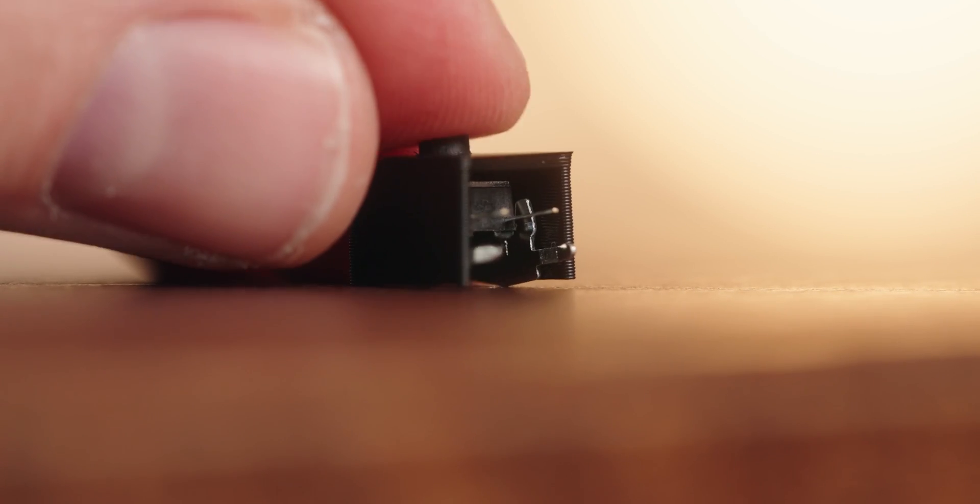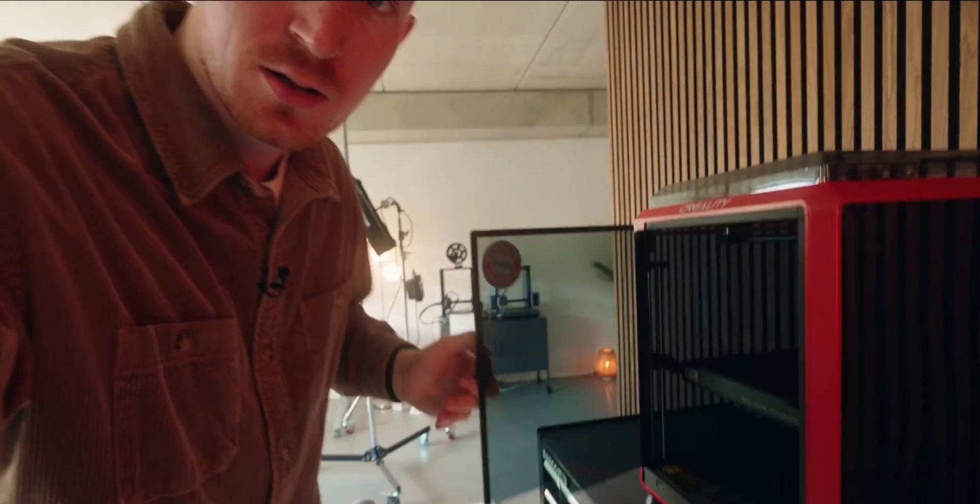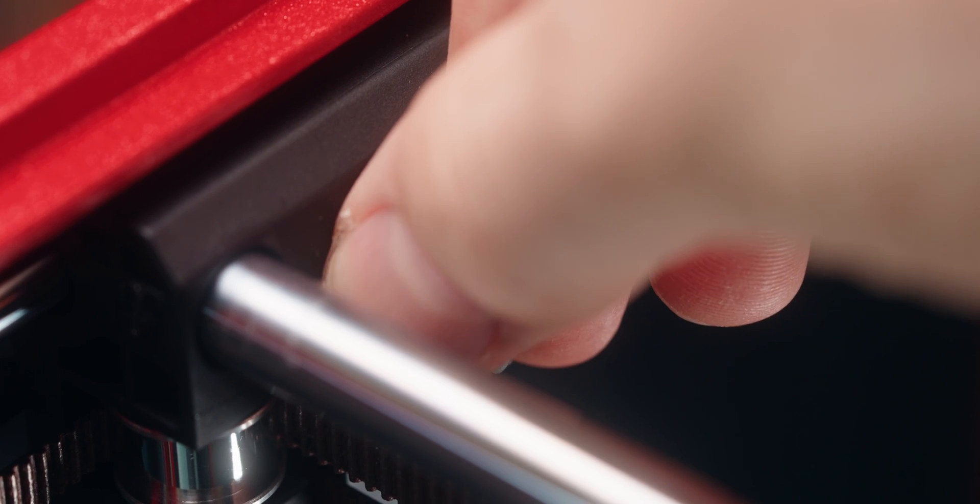V1 of the casing for my button has an issue — the hole diameter isn't big enough so the button can't be pressed. That should be an easy fix, and I just need to figure out how to give it a floor so I can glue it up. I'm going to make some tweaks and print the next version. The new version is up and running: I made a bigger hole which finally works and friction-fitted the bottom part. Now I'll just glue this into the printer and then we can test and start the G-code script.